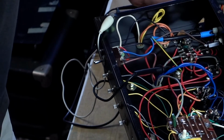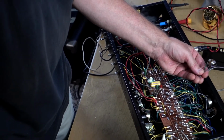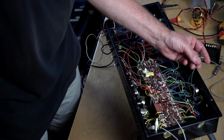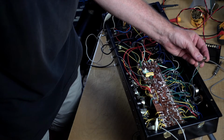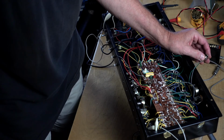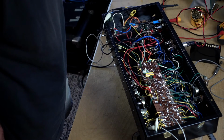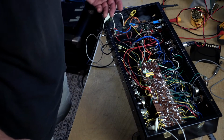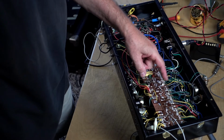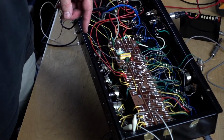Anyway, on top of everything, the foot switch jack for the tremolo supposed to be isolated from the chassis. If it's not, it shorts the generator to the ground and nothing comes out. This all fixed, looks like it's working fine. Now I have to put everything back together, and this also, I changed the caps in the tremolo circuit.